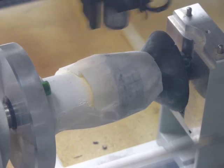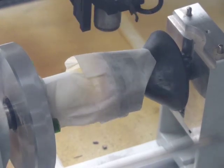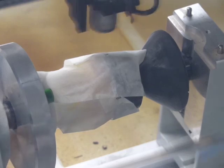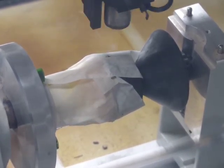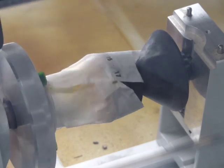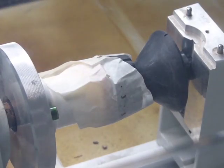So the torque selector 3D printed part, it's been painted in black already. We're using the same method with the special masking tape and engraving through it, although I'm using this rotary indexer, so it's a spinning axis, so you can engrave or cut round things on the laser cutter. It's not something we expect you to know how to use yourself, so come and speak to one of us if you want to use this device.